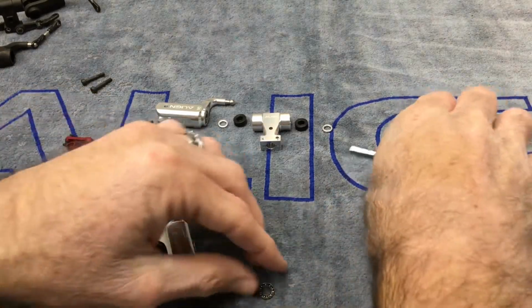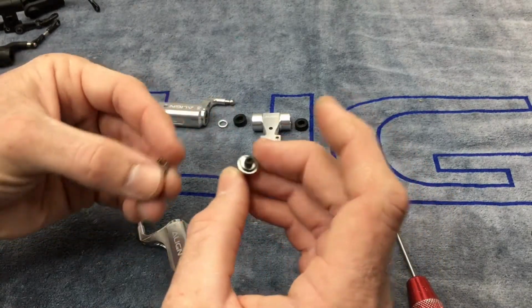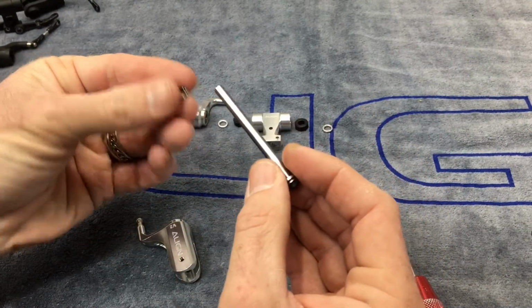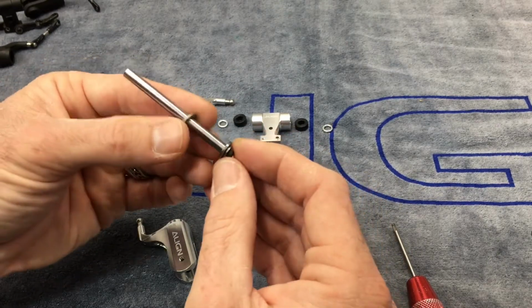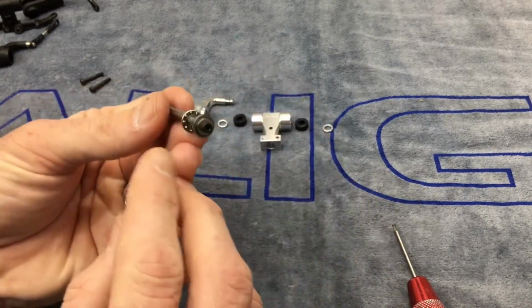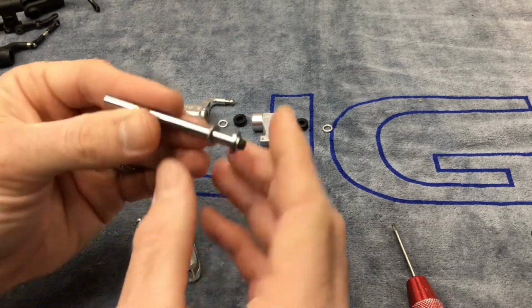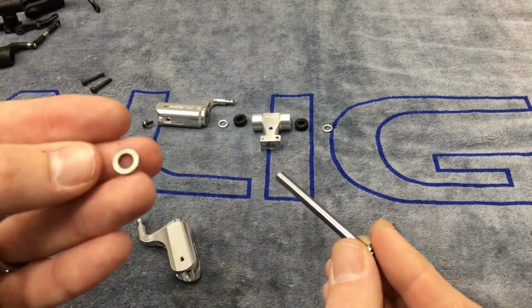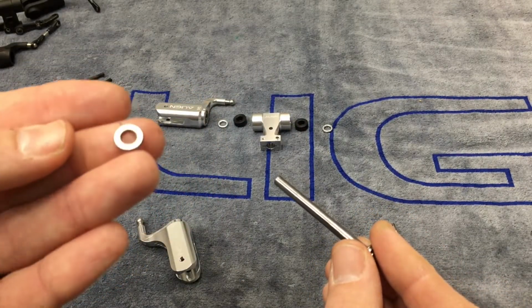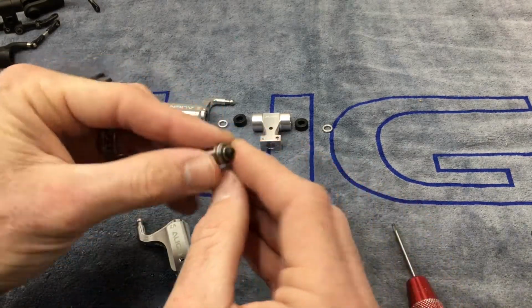And now we're just going to go ahead and assemble it onto the feathering shaft since our outside thrust bearing race is there. Again, I already just greased these bearings. If you have not, I would recommend greasing them. So now we're going to slide this in. Again, closed side towards the feathering shaft bolt. Down, take your inside race. Again, they are marked inside. Too hard to see, but inside and outside. So this is inside. So now we have it assembled like this.